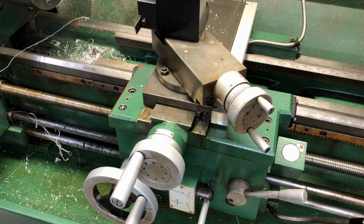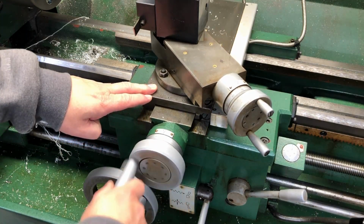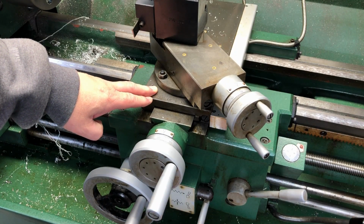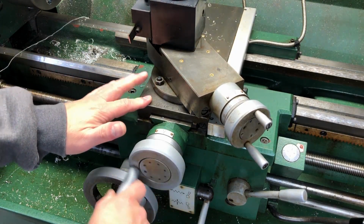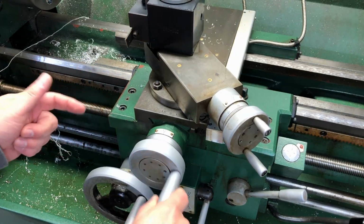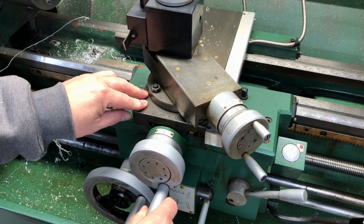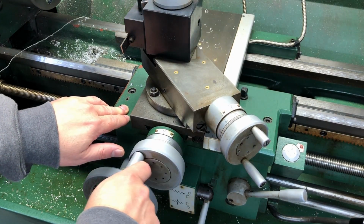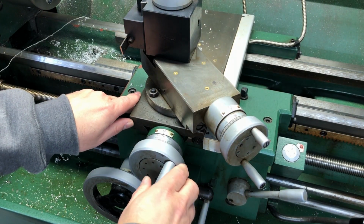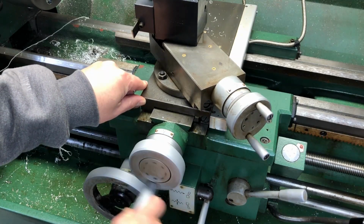One of the other things that I did, and I think some other people out there have done it too, there's a gentleman, I saw the video where he actually had to rebuild his lathe. So what happens here when you're feeding, sometimes this lever is confusing on the Grizzly Lathe. So I didn't pay attention, and I had it, if you could see here, the lathe will not stop. There's nothing that prevents it from going and just destroying itself. I was already close to the end of the travel, and I engaged it the wrong way. And I'm looking at the workpiece here, and by the time I realized, I got lucky, it had run all the way to the end here, and I quickly stopped it. But if you don't, it will continue, and you will do some damage to the lathe.